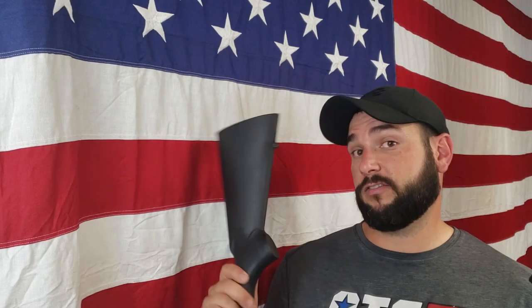If it sinks, scuff and paint. If it floats, you need to flame treat it. Sink, scuff, float, flame treat. Just remember it. It's catchy after a while, I promise.